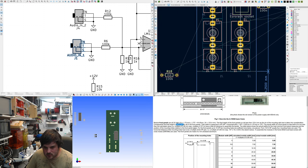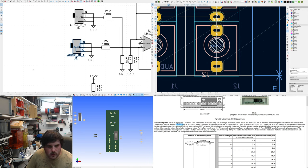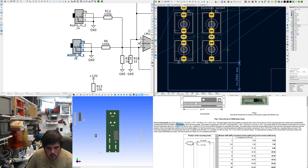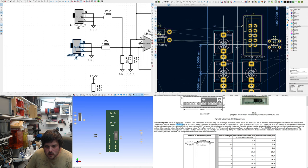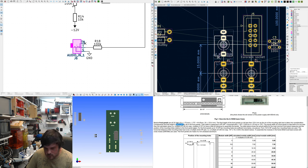Best thing really is to draw lines. So, go to user drawings. What grid are we on? Let's put ourselves on, say, 2.5 grid. Edge of the board is here. Hide this one. Because I can very cleanly measure lines. In fact, if I turn this back on, I can then go, that's 13, that's 15. We want it to be in the same grid. 15.